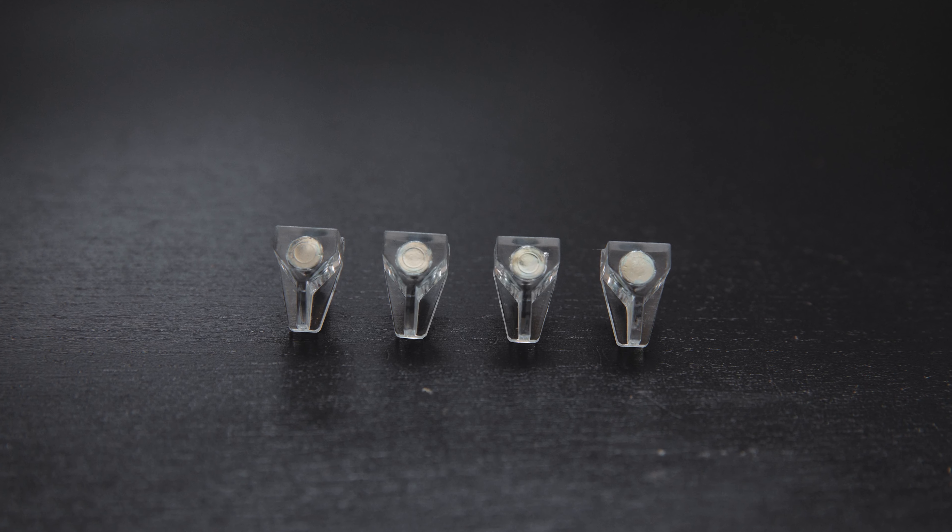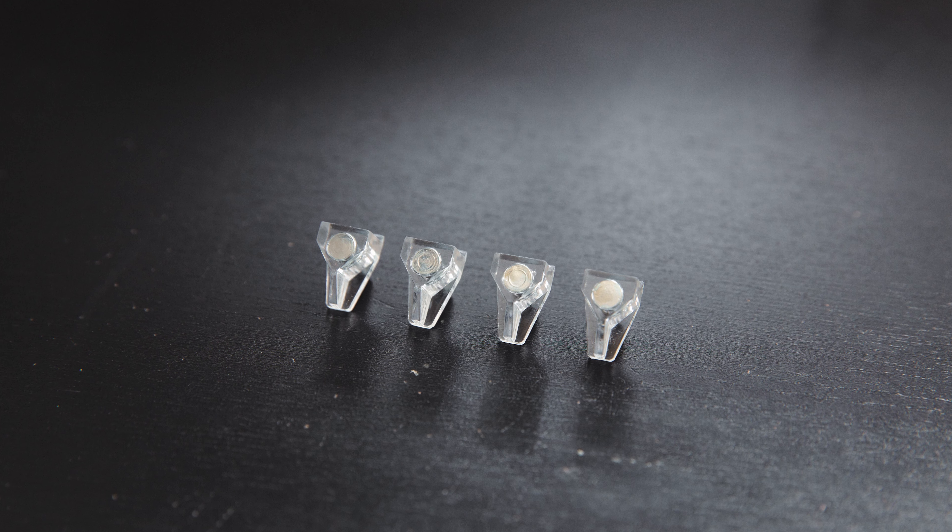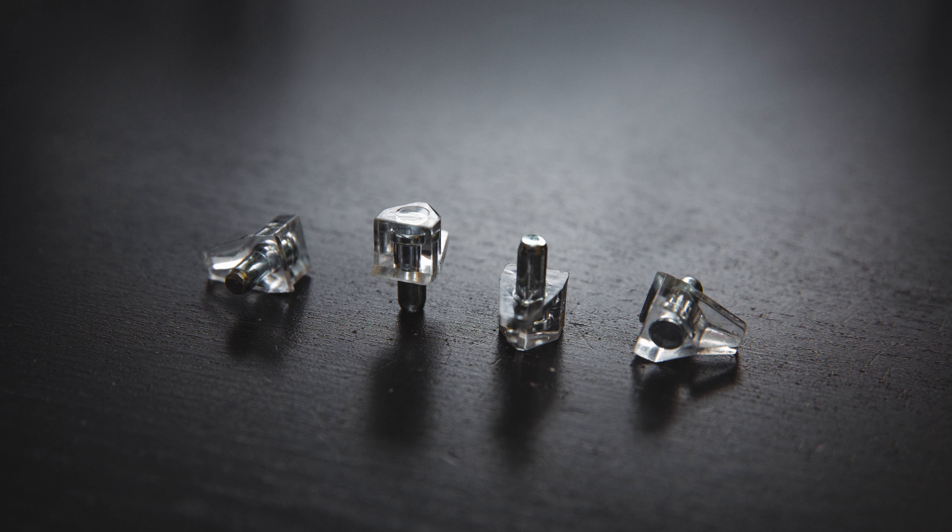These shelves will be supported with five millimeter shelf pins. You can find these at Home Depot — they're really cheap. You just drill a five millimeter hole, press it in, and the shelf will be supported by four points of contact. The tools I'm going to be using are a circular saw, a jigsaw, a handful of clamps, some sawhorses, and a long straight edge. I'll also use a drill for the shelf pin holes and screw holes, and I'll apply some primer to seal the edges from moisture since this is under the sink.